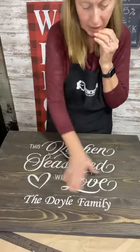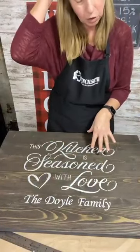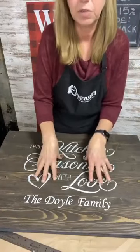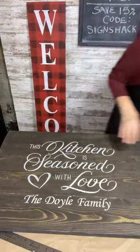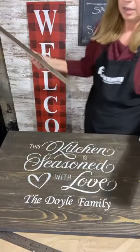You also want to, I didn't bring mine out, and you should let it set a little bit, but I have some Fusion Mineral Beeswax. You want to put something food safe on this, in case they do use it, they could double it as a charcuterie board. That's how you say it.